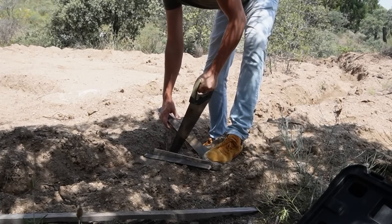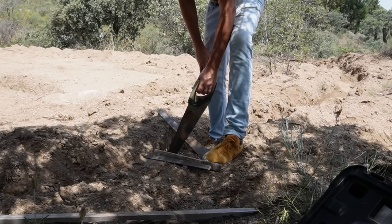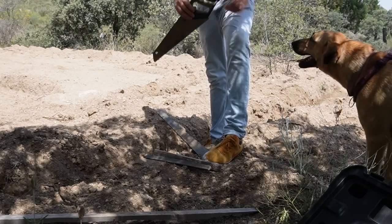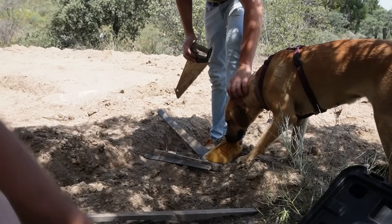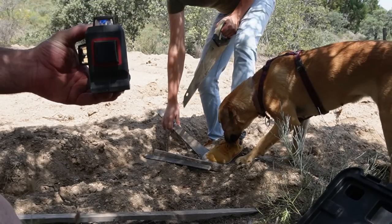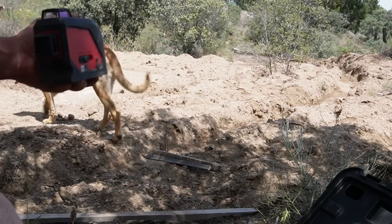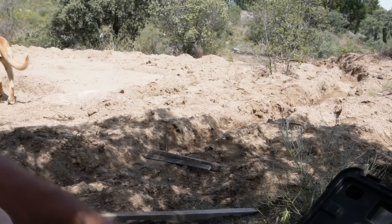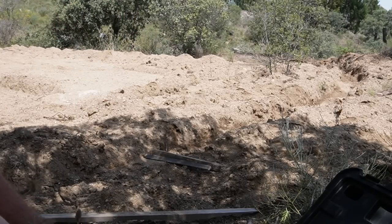So we're here at Cindy's with Miguel. We're cutting up some stakes. I'm going to try and set out the foundations with some concrete levels and a better line. I've got my fancy pants laser level here, so I'm going to set this up on a tripod, and we're going to use a staff and a receiver level to put some levels around, and then we can start thinking about when to do concrete and things.